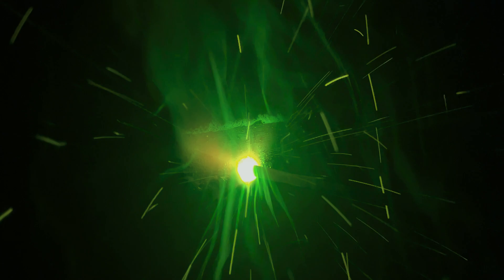This footage isn't the clearest — the next bunch of arc shots are much clearer. You can see my travel speed is pretty slow, I've got an upward push angle, and I'm just feeding it in and letting it fill. The molten puddle is about twice the size of the rod diameter. If the puddle lengthens I'm moving a little bit faster or pushing more rod; if it shortens I'm slowing down.